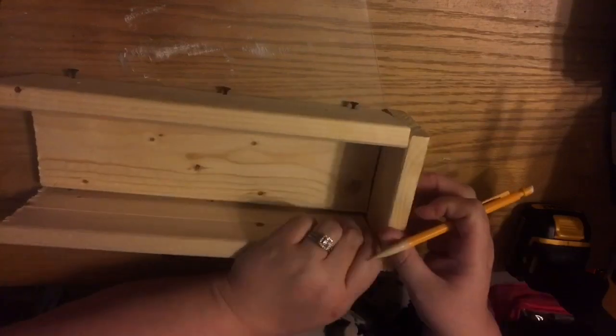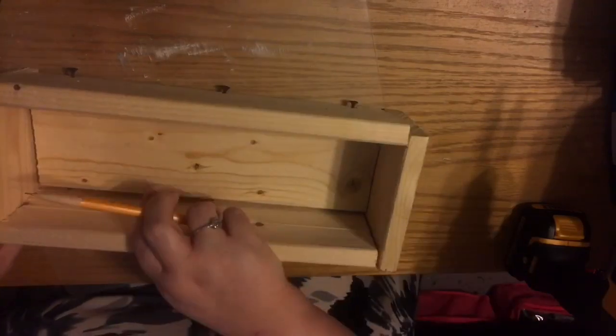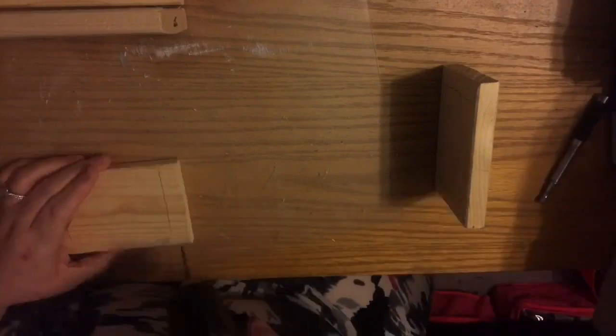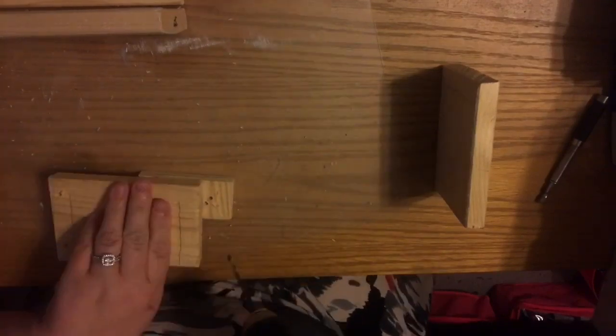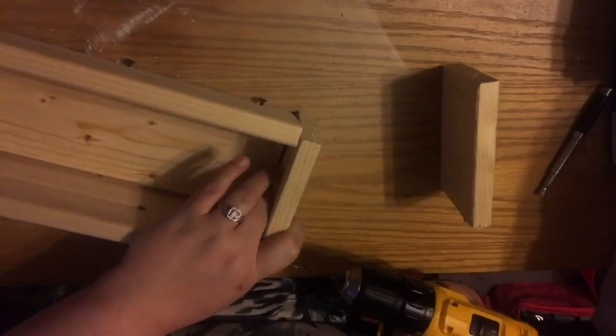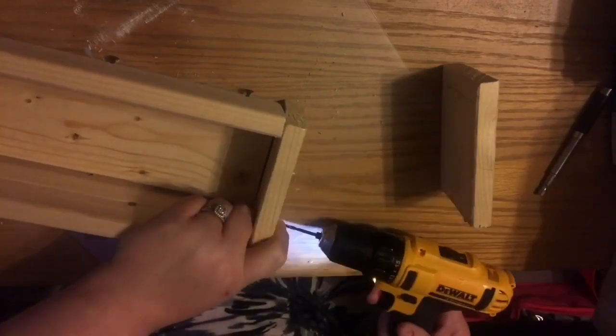You're going to mark where you need to pre-cut. I'm marking on the inside where I need to pre-drill, and you always transfer that measurement to the inside. You could pre-drill the ends first, and once you have the ends up against the side then you can pre-drill through that hole that's already there — that's helpful if you have trouble holding the pieces of material together.